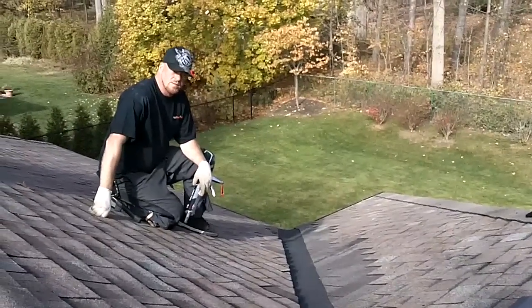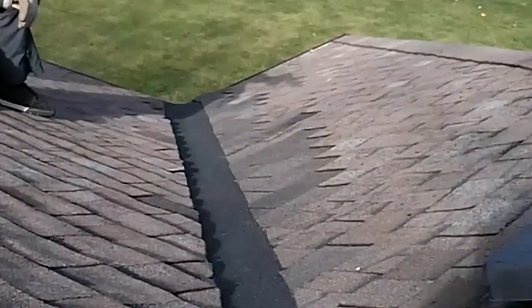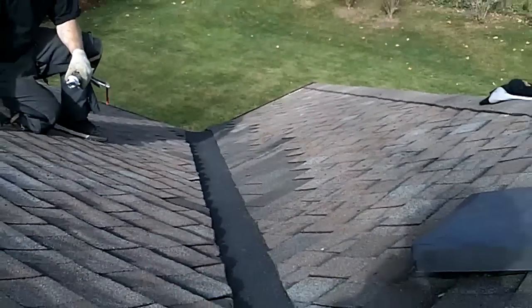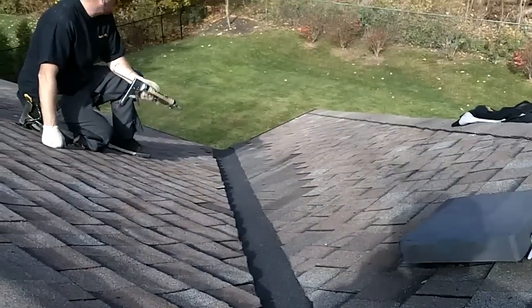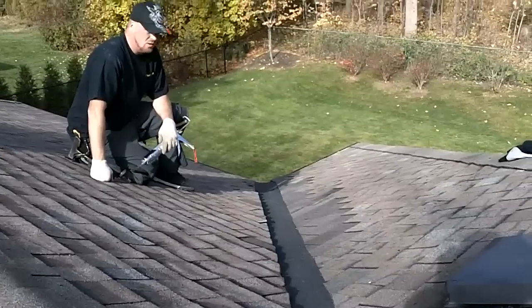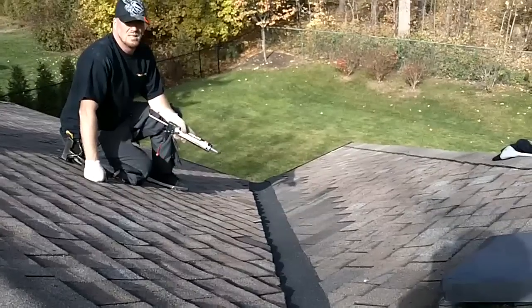There you have it — finished product. We actually had to re-nail and replace all the shingles on this one side particularly, because it was just caulked like mad. Now we've made a valley to force the water down to the eavestrough. You can see how professional it looks. This does not take value off your roof — adding tar to make a mess does.